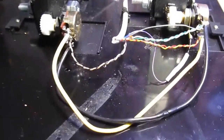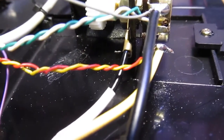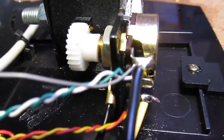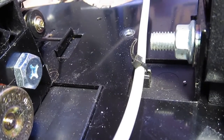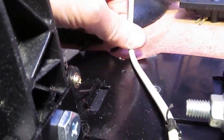Here's what it looks like after getting everything wired in. I've got a jumper running from the accelerator pot 5-volt connection over to the 5-volt connection of the brake, and a jumper running over to the brake ground. I used a zip tie for strain relief, and when the cable comes through the case it gets more strain relief, so I think it'll be fine.